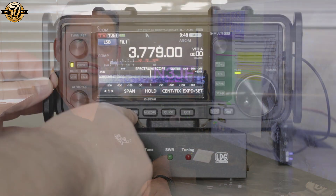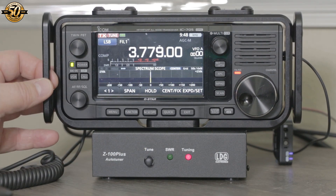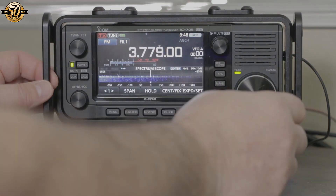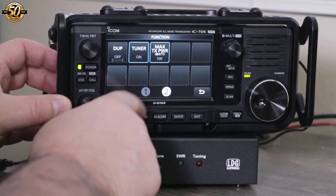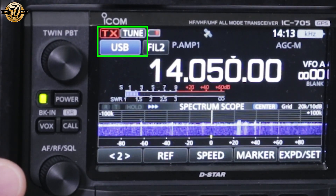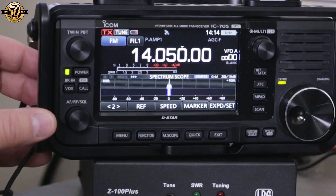To initiate a tuning cycle, select an operating frequency and long press the tune button. The tuner has to search for a good tuning solution and it takes a few seconds. Once found, it stores that solution in one of its 2000 memories. If I switch to FM mode and key up, you can see that the SWR shown on the meter is a one-to-one match. On 20 meters, as I start the tune, you can see the tune display blinking as the tuner finds a solution — and in this case the solution was found very quickly. Checking the SWR in FM mode shows an SWR of less than 1.1 to 1.